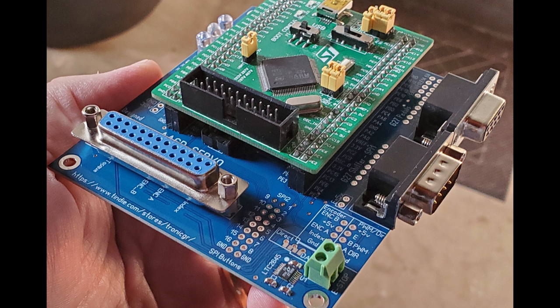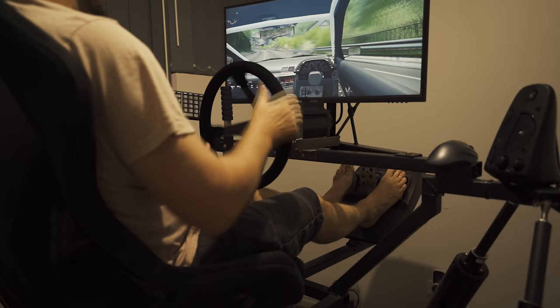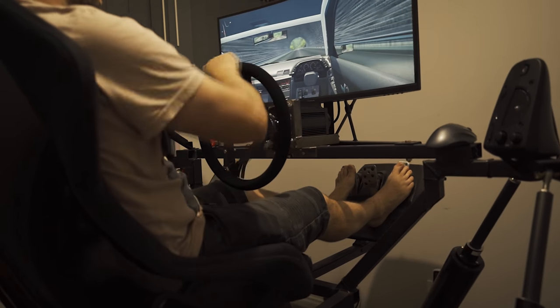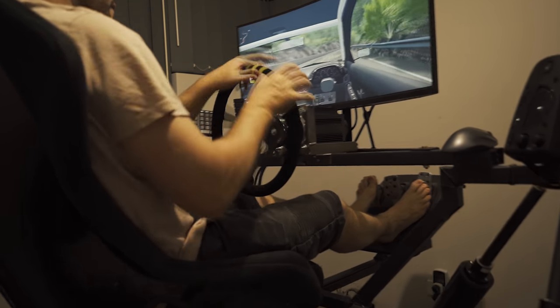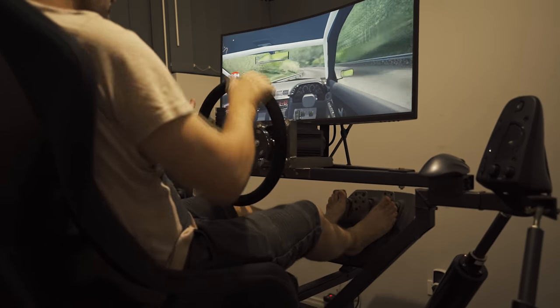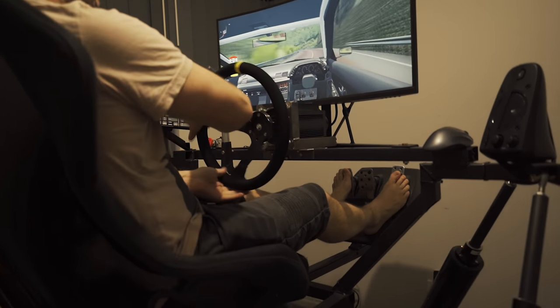Currently, one of the biggest downsides is it has a fair bit of noise, so it feels like a slight bit of sand in the motor. This can be counteracted by some filtering, which is PN188. Now, the more filtering you put in, the less fidelity you get in the car racing game. So the good thing about the DAC is you can actually lower that right down to 1, have no filtering on the driver itself, and have a pure analog signal and get rid of all the noise, keep your fidelity.